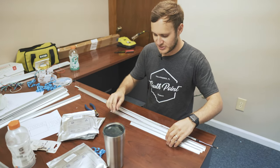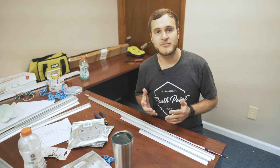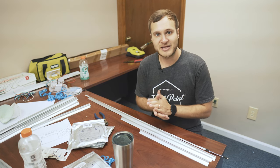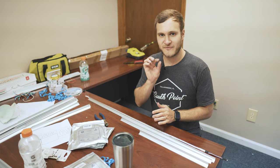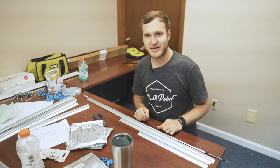These are the sizes we're going to work with for our stage design. We cut them using a jigsaw — please make sure you're using a metal blade. We used a very fine metal blade with teeth that were very close together and very small. Use that to be sure you don't get any kickbacks.